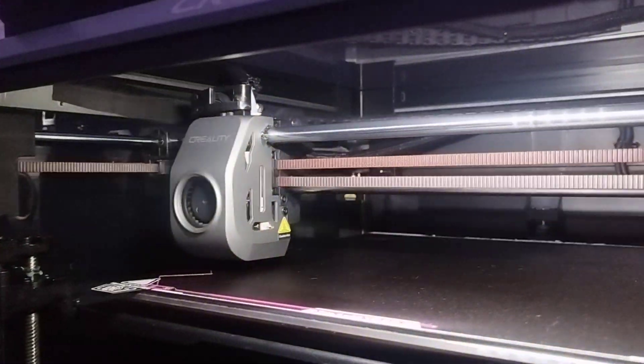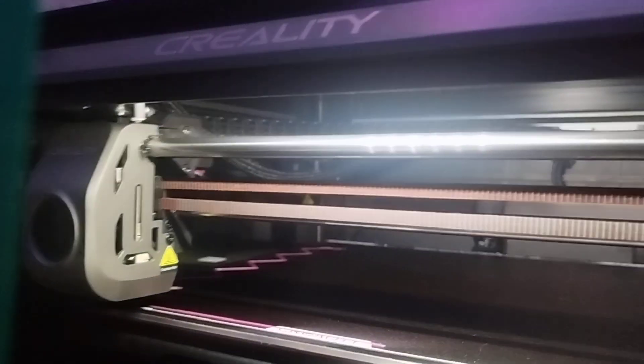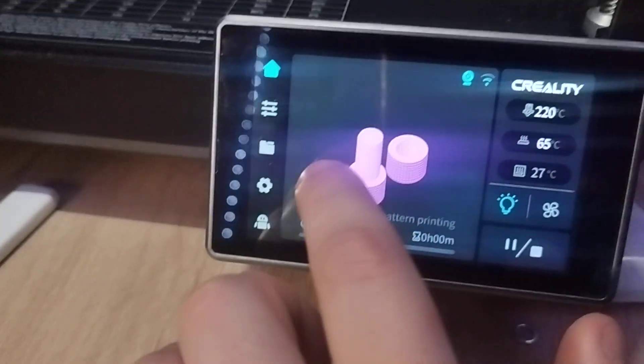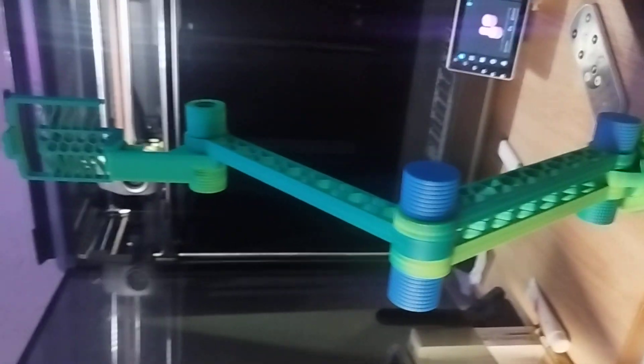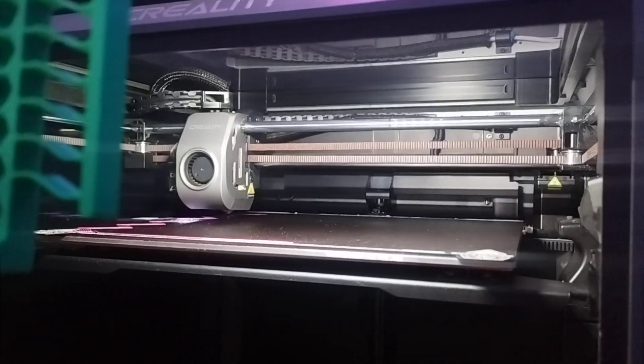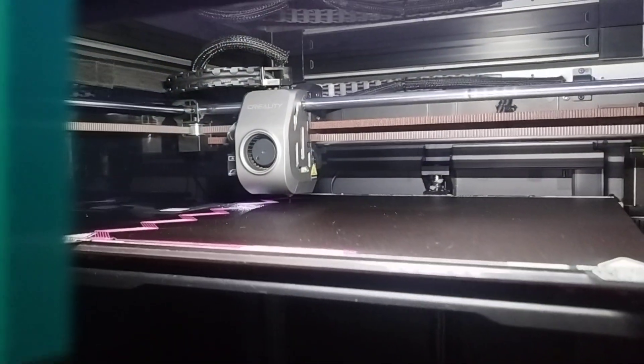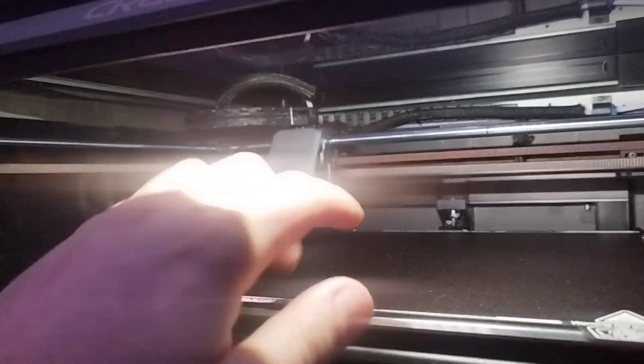Now it's calibrating the flow. We'll print another set of screws and nuts for my printed arm, because I broke this one last night — this must be flush with the cell. Now the LiDAR is scanning the pattern. We'll see how it performs. Also, before I switch to the texture plate, I do a full bed leveling because this one is different from the original.